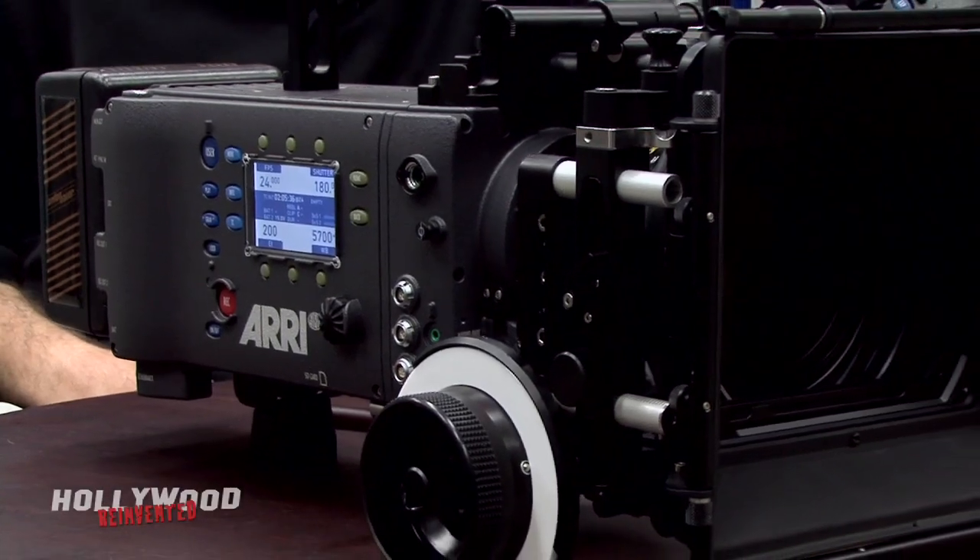So let me give an overview of the camera. The Alexa uses a CMOS imager — it's a 3.5K sensor, which means it has 3,500 pixels across horizontally. We use what's called a Bayer imager, and it's a way of encoding the video so that you can get RGB video out of it using a single plane instead of a red, green, and blue sensor.